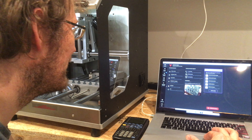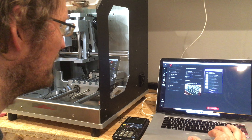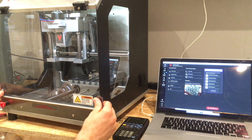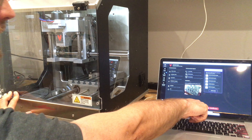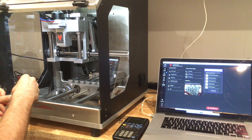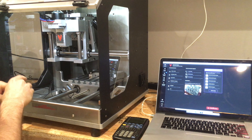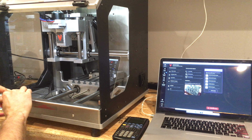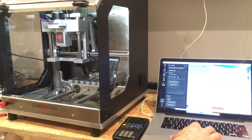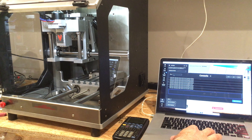There's a home button but it says 'safety cover is open' — which it is not. I can show you that clearly — if we close the cover, the safety cover is definitely not open. Let's just put the magnet there so we don't have to listen to that silly beep anymore. It's just stupid to have that on a CNC machine. Let's launch the debug console.